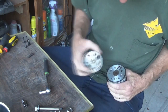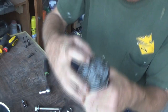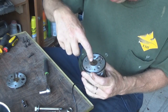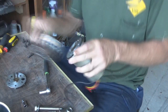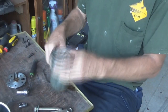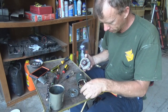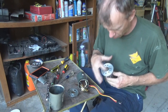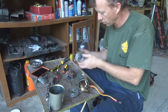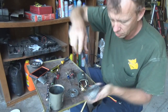I start popping those seven-sixteenths bolts loose — this is all the mechanical side of the motor. I had never taken this thing apart and never seen a video about it anywhere, so I decided to take it apart. I had nothing to lose — if it didn't work it didn't work; if I get it to work, great. You can see some junk and a little gear there that should be turning. I thought there are two ball bearings inside that valve. Then on the electronic side where the magnets and windings are, I pulled that out of the housing pretty easily.